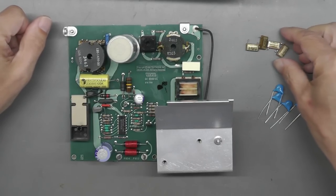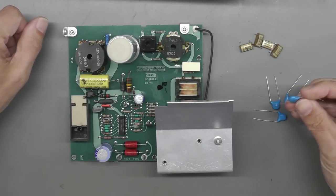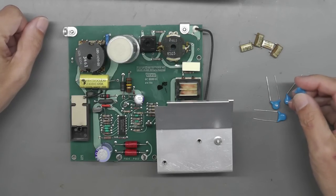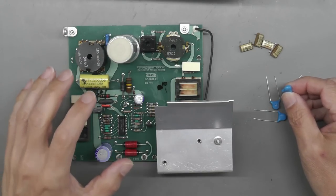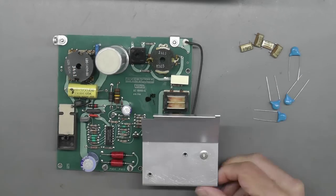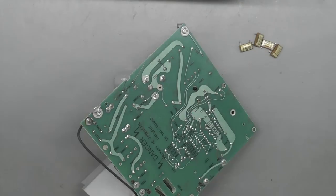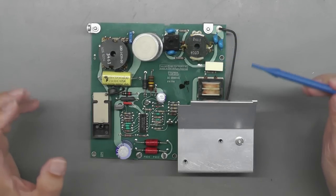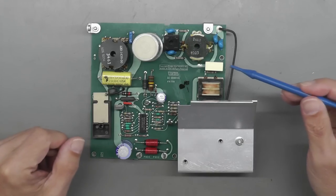And so with the Y caps removed, I've actually got four new single layer ceramic capacitors, Y1 class, the same value as the original ones, 2.2 nanofarad. So let me fit those onto the board here. Then we're actually going to take a look at the schematic for this board and just get some kind of idea about how it works. Okay, capacitors fitted, as you can see. Right, so this board is known officially as the A18 pre-regulator board.